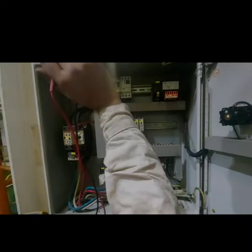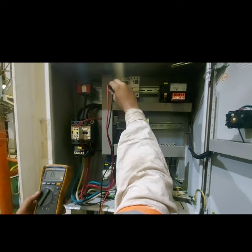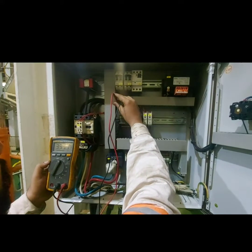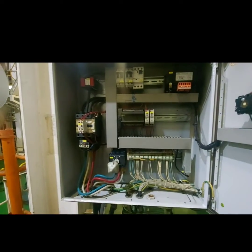I have tried this method on various PLCs like Allen Bradley, and this method always works. First, we checked the input power — 220 volt to the main PLC — and found the input voltage of 220V or 24 volt DC is present, but there is still no run indication on the PLC.